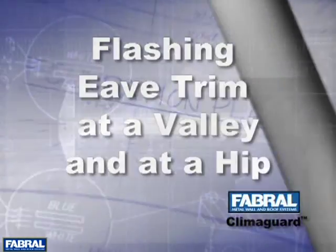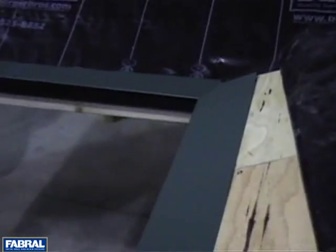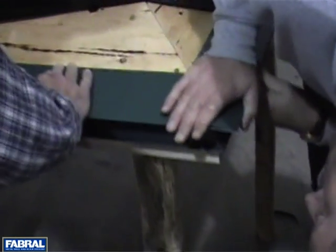Note, the use of graphite pencils on painted steel will corrode over time. Cut the trim as shown or needed and attach as described previously with roofing nails and screws. Take note of the angles cut to allow for the trims to overlap. Sealant should be used between any trims that overlap.